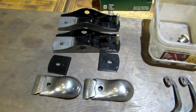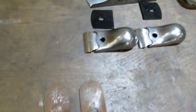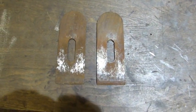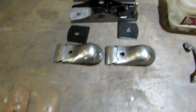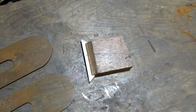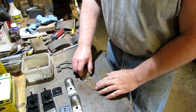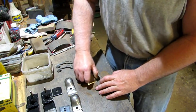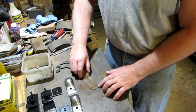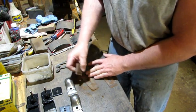The dirty oil has been on overnight — had to take a break for supper. I've got to take care of these two irons and all the small parts before this project is ready to reassemble. The first thing I like to do is scrape them to get the bulk of the crud off. When you're scraping, make sure you've got a fresh burr on the edge and keep your scraper at an angle to your work — you're less likely to gouge the metal.